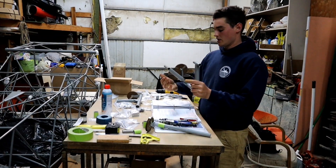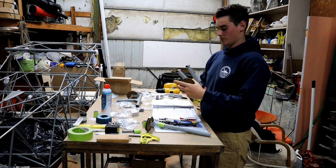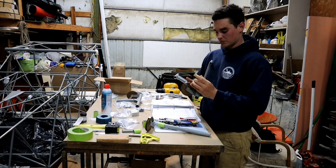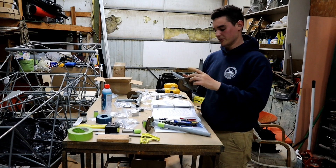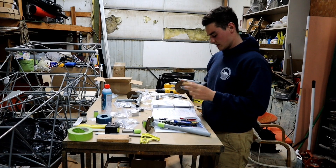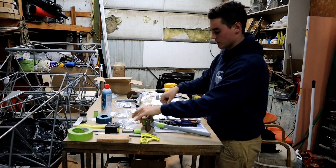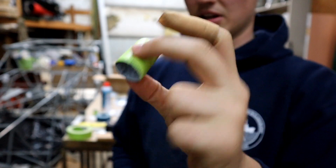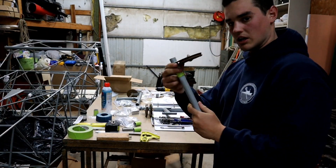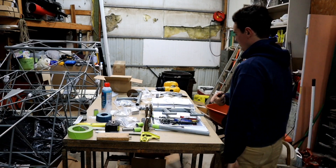Here's what we worked on today — this is the rudder pedal assembly with the optional adjustable rudder pedal. I had to put these pulleys in and fabricated these little stainless steel straps, which I cut my finger pretty badly doing — this is why you should wear gloves. Duncan sanded these down and got the bushings just right. He has a very clever method where he masking-taped sandpaper and just slides it over the end and sands it to fit, which is genius. Duncan is an expert sander.